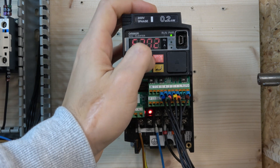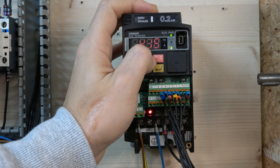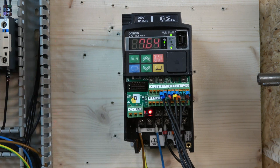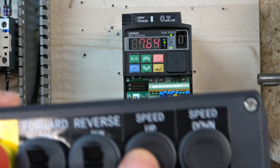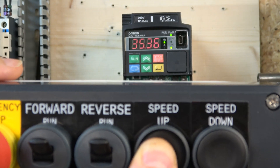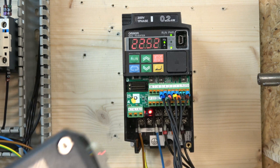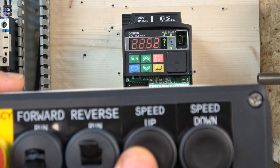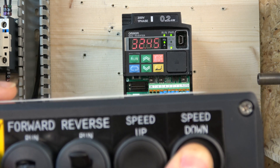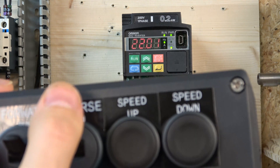I'll set deceleration to 10 as well. That will very much impact the sensitivity of your button. Now look at the buttons — you're holding it and it's going a lot slower. It's pretty much reflecting the actual acceleration and deceleration times on the buttons. Let's power it on — as you can see it starts up quite slowly, goes up, and then comes down at the same deceleration speed.